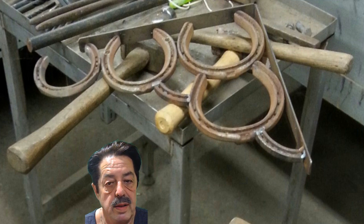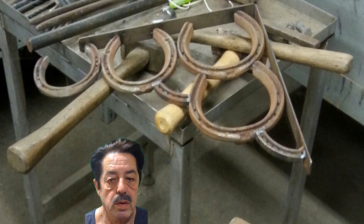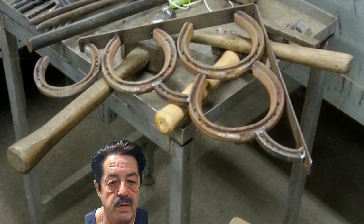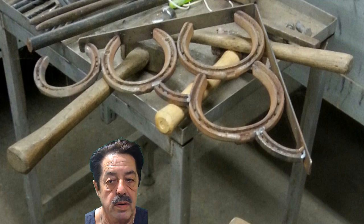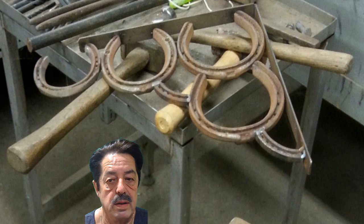From there you just set the horseshoes in a pattern like this or similar to it and go ahead and weld it up. There are a couple of things I do ahead of time: I cut the nails off the horseshoes using a four-and-a-half inch angle grinder cutoff wheel. Then I have a wire wheel on a bench grinder and I clean them up fairly well, because you're also prepping for welding at the same time.